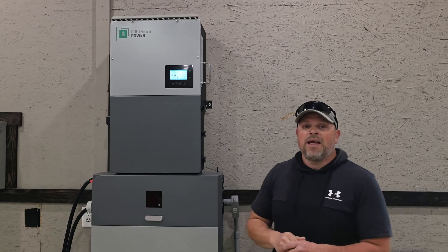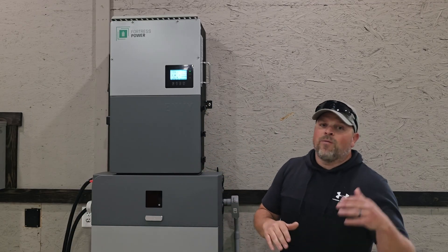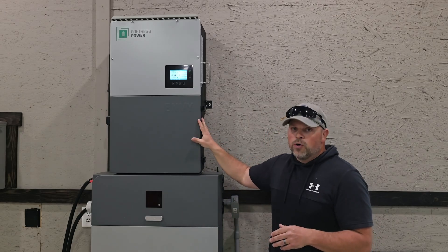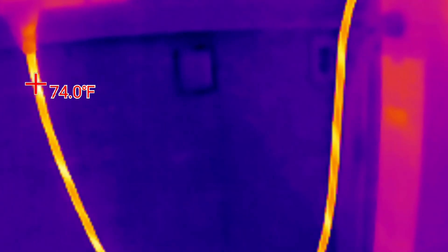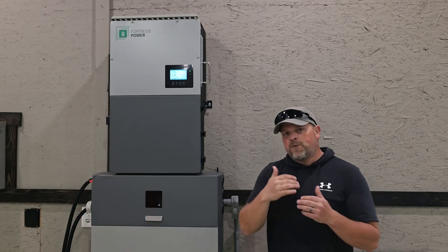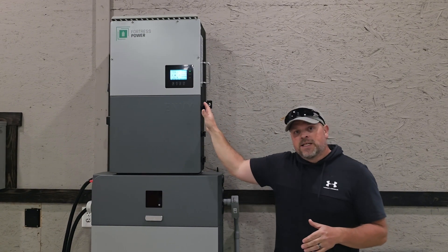On one single inverter, you can protect your food supply, keep your house warm, leave the entertainment on, keep the lights on, and even have the luxury of hot water. And the NV12K is not a gimmick — this is the real deal. This thing was putting out 12,100 watts at one point and we didn't have any problem with it whatsoever. It peaked up there for a very little amount of time, then ran constantly at 11.8 kilowatts. So we were testing the true 12K on output for over 25 minutes. Then I started to get concerned because my breaker started to overheat — once it goes over 140°F I get a little concerned, and it wasn't worth it to me to risk a fire in my load center. So I pulled back and ran this for a total of 45 minutes at a good discharge rate, discharging the batteries over 35%. A pretty substantial test and everything passed — I'm extremely happy with the results.